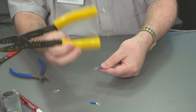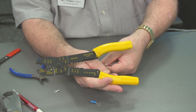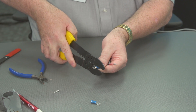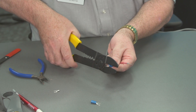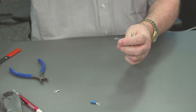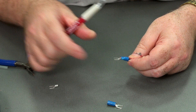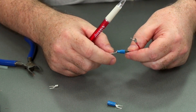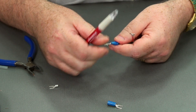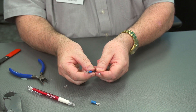Let's get our tool. You can see there's a spot that says insulated closures — that's the spot we'll use. We'll get the blue dot because that matches the size we have here, and we'll match it up, line it up, make sure everything's just right, and give it a squeeze. You can see that's a good squeeze — it may be a little ambitious but it will hold very well and still protect the cable. Let's flip it over — there's an indentation on the other side as well, so that's a nice strong connection. You can pull on it and there's not too much wire sticking out, just enough to confirm there's wire there. It's a strong connection and that'll work just fine.